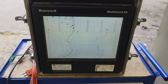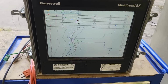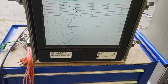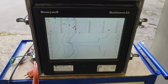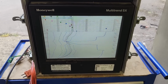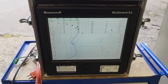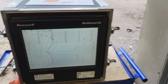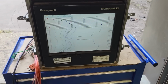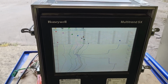It's genius, brilliant. Told ya. Chart it and then we know exactly. Okay? You need to do a zero check. You didn't do one to start off with. This is kind of zero now. Zero carbon dioxide, zero carbon monoxide. Yeah, but your oxygen was out, so is it working properly? No, it came back again. Doesn't mean it's working right.